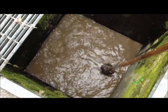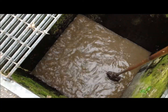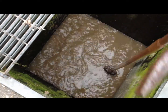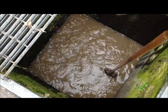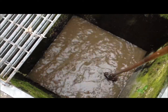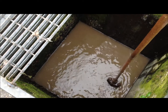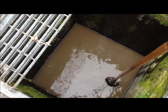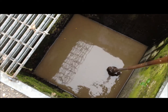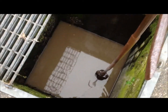Close the valve up slowly so you don't shock the tanks. If you shock the tanks, any sludge sat on the walls of the tank will come loose and float to the surface — I'll show you how to deal with that in the next video. Continue to close the valve slowly. You want to put a bit of water into your sludge holding tank, but if you can't dewater it, you don't want to put too much water in there. If you haven't got dewatering capabilities, speak to your manager or bosses to see if you can get some kind of dewatering method put in.